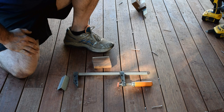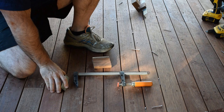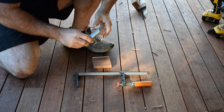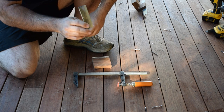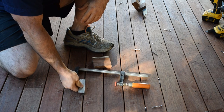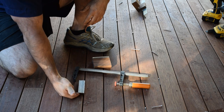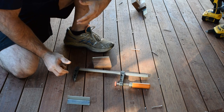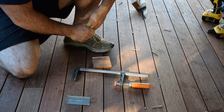Here's a quick overview of some of the tools I'll be using to get this decking board straight. Throughout the building of the deck I like to keep my decking boards in an even spacing. Some people use a nail, some people use a screw — I like to use a piece of metal angle, about 2.5 millimeters thick. You put that metal angle in between the decking boards and sit it on top of a joist so there's room underneath it and you can lever it out later on. That consistent thickness also helps the look of your deck so your boards don't end up too far apart or too close together.